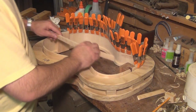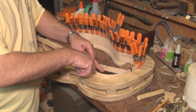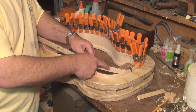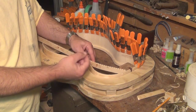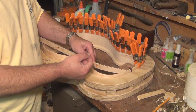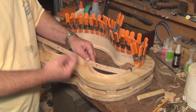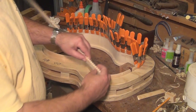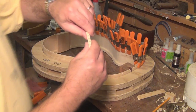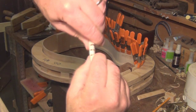I'm going to start by putting it into the upper bout, and if I just start pushing this in, one of these kerfs is going to break first before the other ones do. And then it's going to get very weak, and it's going to take the brunt of all of the pressure that I'm putting on this and possibly crack. I want to see if I can do this in one piece. So I've got a fairly tight upper bout here. I'm going to take this and I'm going to purposefully break